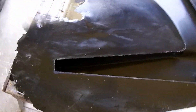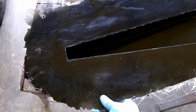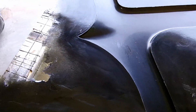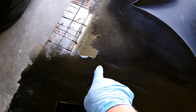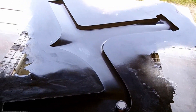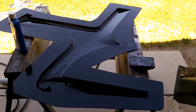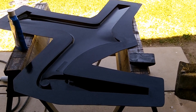The other thing we need to do is cut a flange on here. I don't like dealing with all the excess, and it gets thin out towards the edges, so I'll cut it probably two to three inches and remove everything that's excess. That'll give it a better chance of surviving and keep cracks from going all the way across. I'll get this thing cleaned up. Here's the finished mold after being cleaned up — it looks pretty good. Just got to wax it down and get it ready for putting carbon fiber in it.